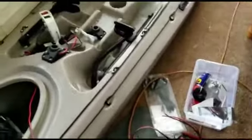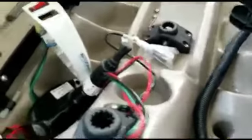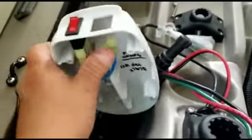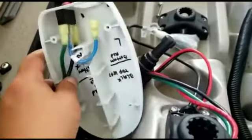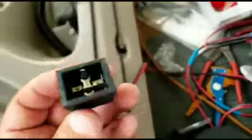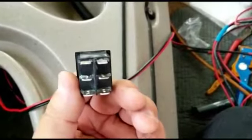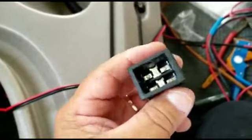I had an intermittent problem with the control switch for the Water Snake electric motor. I had to take the switch off and it had a lot of corrosion. I got the back cover already marked because there are a lot of wires going in there. This is what the switch looks like — still got a little residue of the greenish stuff. I put it in baking soda, soaked it, sprayed it, and still got some of that green stuff.